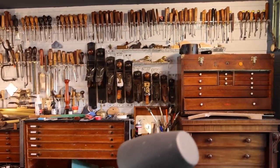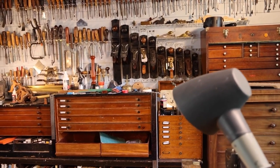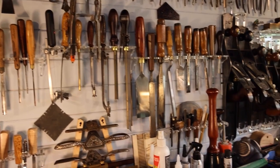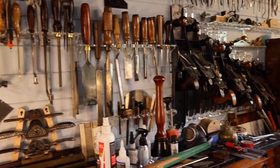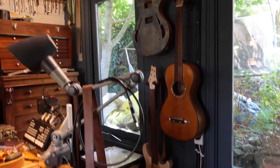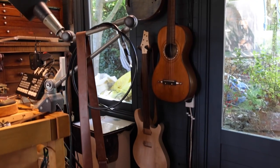All of this work has been to increase my storage space and make it better for the timber. Throughout this extension, I've been doing it with guitar building and timber storage in mind. Every single surface in this shed is fully insulated — roofs, floors, ceilings, walls. I have a heater on a thermostat that keeps the temperature at an even number, and I have a dehumidifier going whenever I'm not filming to pull out excess moisture, to keep it at around 50 to 55 percent.